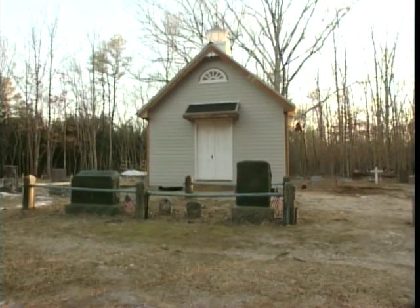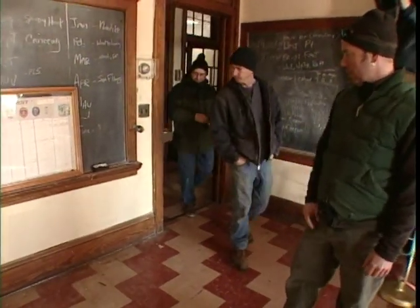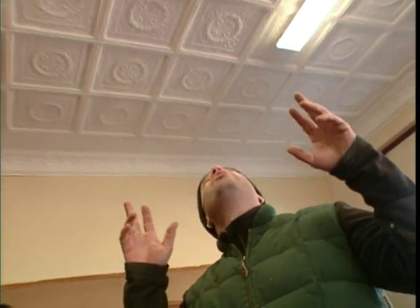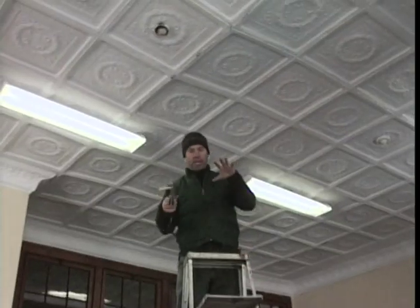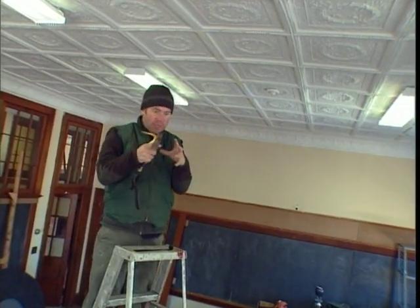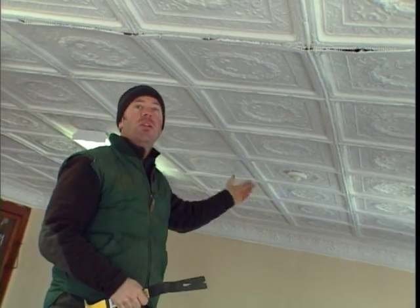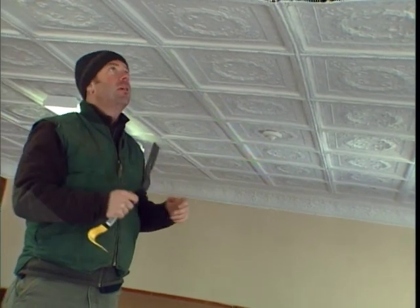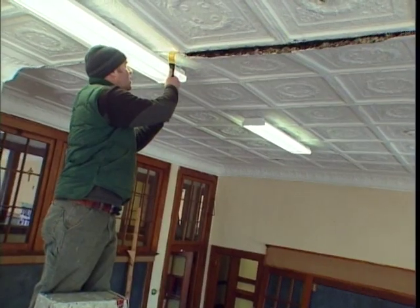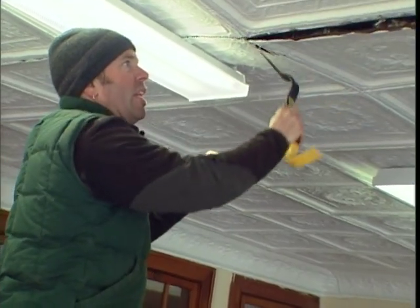We collected some great stuff for the new chapel and we're salvaging great finds from the convent school slated for demolition. Now the tin ceilings are coming down. Pressed tin was made with a giant reverse mold — they'd press it and extrude it into design patterns. The key is figuring out the overlap, almost like doing flooring: find which end they started with, then go to the other end and work your way back. It's a dirty job but totally worth it. The whole thing is to get it down without completely ruining it.